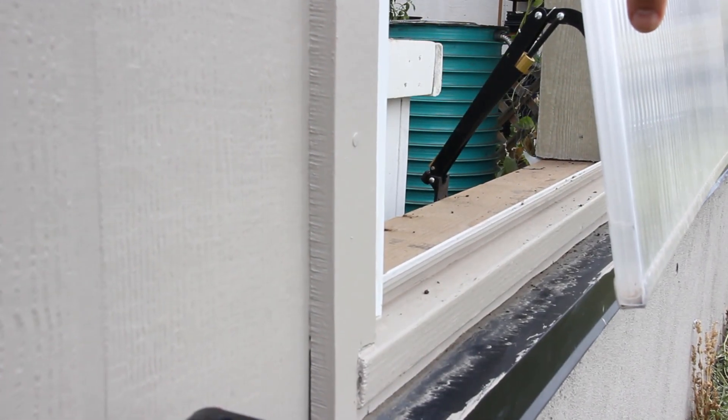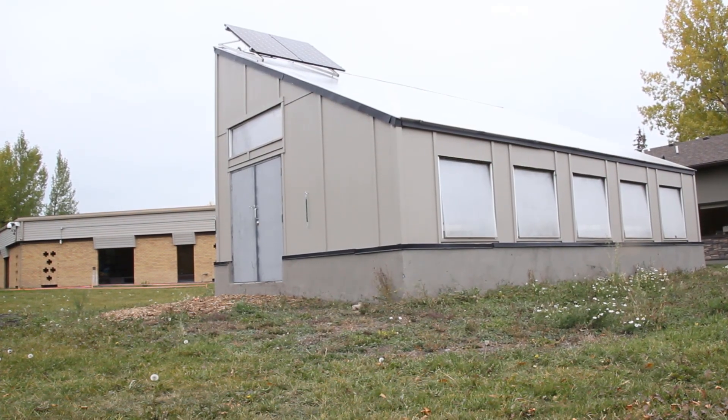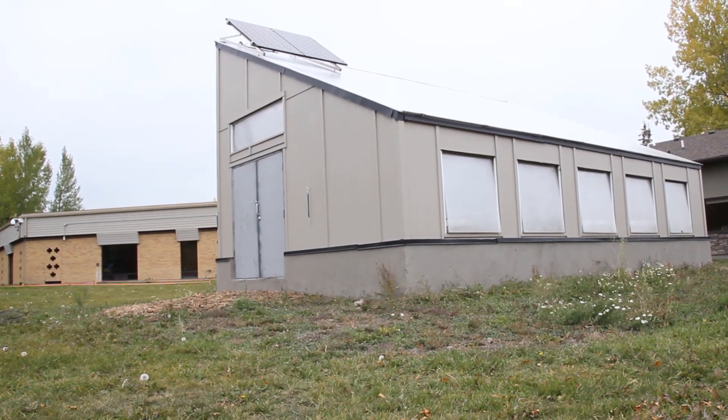You'll notice the windows behind me are fastened with a piano hinge, which is readily available from your local hardware store and really easy to install. One side is fastened to the greenhouse, and the other side is fastened to the glazing panel itself. Behind the glazing panel there are rubber gaskets so that when the window closes, it seals against the greenhouse to reduce infiltration. This greenhouse has similar vent panels on all four sides, which are both removable and operable based on these wax-based cylinders.